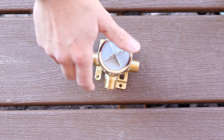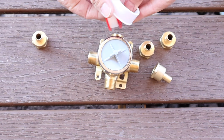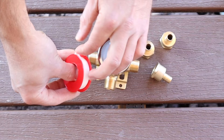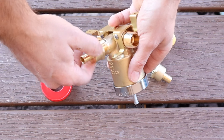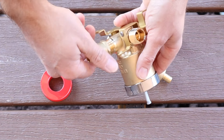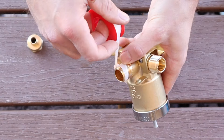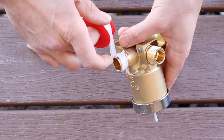The first thing you're going to have to do is use Teflon tape and install it on each one of those threaded sections. If you've never done Teflon before — if your fitting turns this way, you want to wrap that way and snap the tape this way, because if you thread the fitting on going the other way it's going to unthread your Teflon. Go ahead and lay it right on your threaded section, and I like to wrap it several times — it takes at least six wraps to get good coverage.